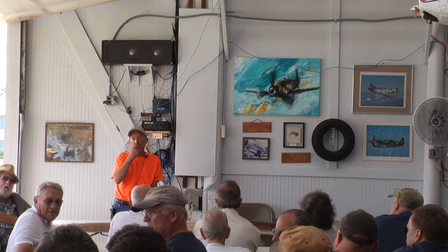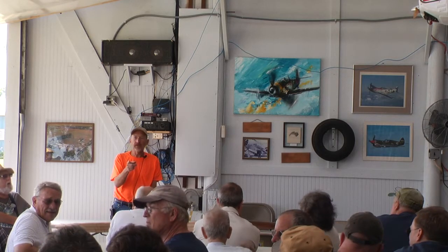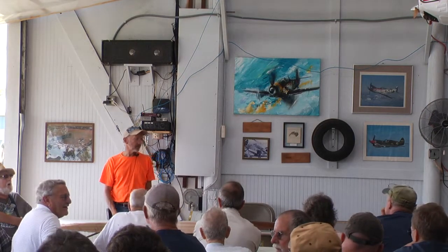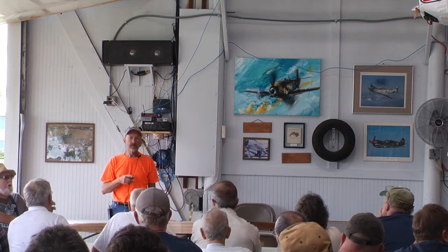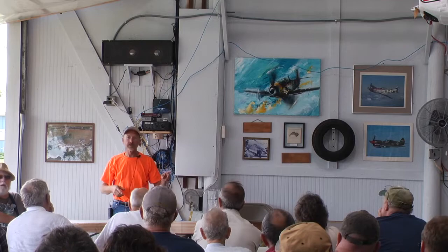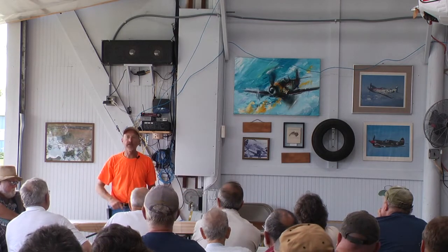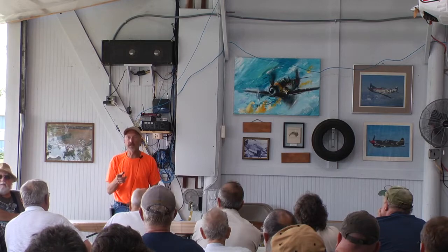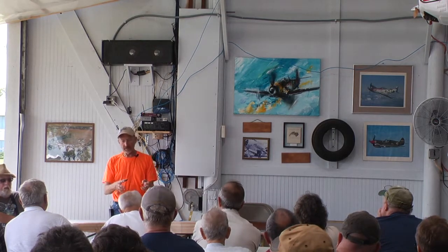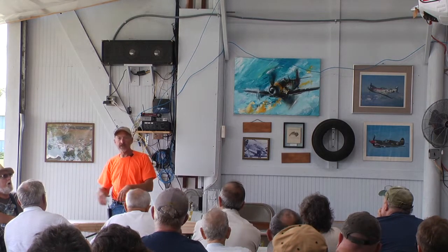Okay, that makes sense. You put the paint on, and it would start to run, and come around. I've seen bowl makers do that. Actually, all the runs will come out and smooth out. I see, that's a good idea. Phelan made a mandrel and powered it with a barbecue motor so that once it started to spin, it spun very, very slowly so that it wouldn't create any drips. And by the time the finish was dry, it didn't have a chance to create any drips, right? Right. Like I said, I saw some bowl makers that use that same method. They keep the bowl mounted in the lathe, turn the lathe on real slow, wipe their finish on there, and they can go home at night and let it spin all night like that.